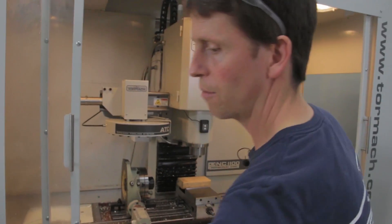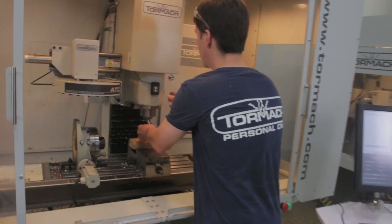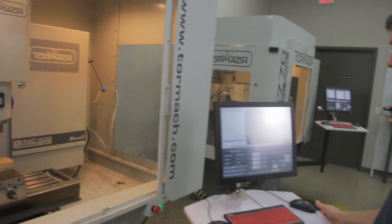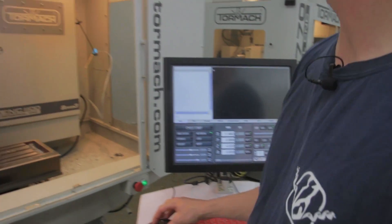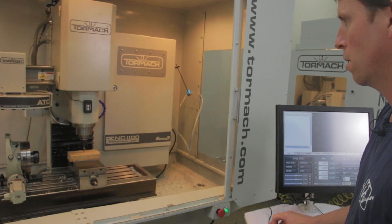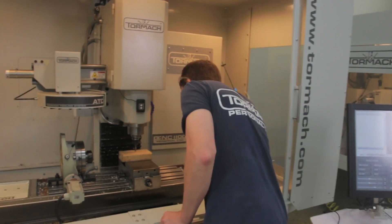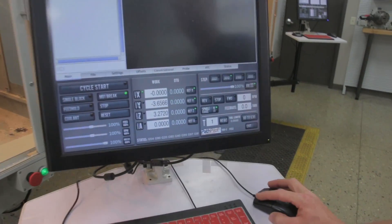To get your XY zeros, if I were machining something other than just a piece of wood and being accurate, I might use something like a Haimer or a wiggler edge finder. Those tools would work great for finding XY zeros — that's covered in another video on work offsets. But for now, I'm just going to get close. I'll go ahead and put tool 1 in the machine. It's a good practice any time you put a tool in the machine to tell it what tool you've put in. I'll use tool 1 to get approximately where I want, then click the zero X button and the zero Y button.